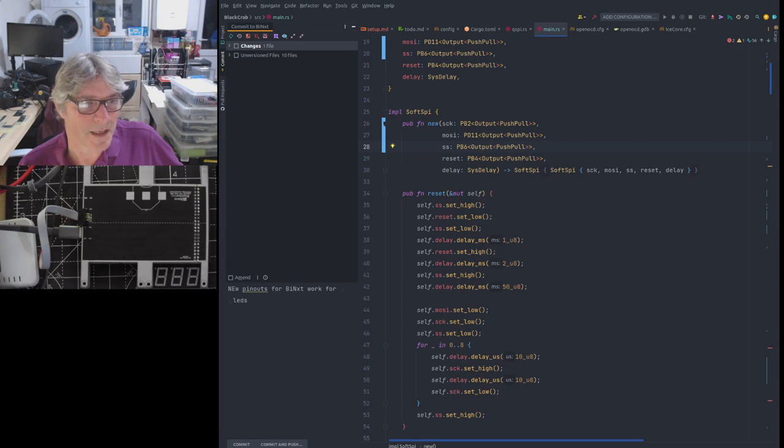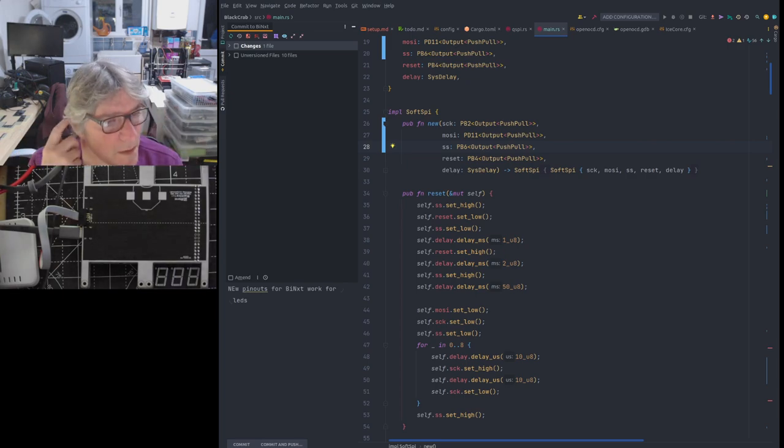Hopefully that clears up where we are. We're programming the ICE40. At the moment, I can program it, but I can't use the QSPI, obviously, because I've got it in the bitbang mode or GPIO mode for those pins, so I can't use the QSPI, but I will solve that. But I'm not intending doing any QSPI stuff today. What I want to do is just make sure that the rest of the stuff is working. So let's switch over to that.